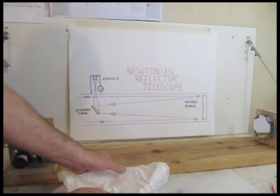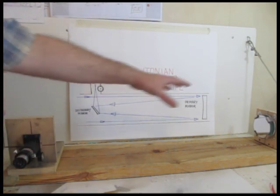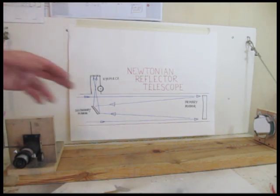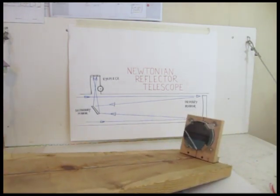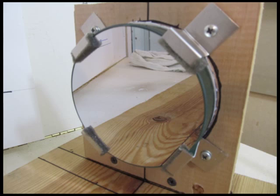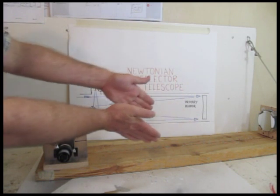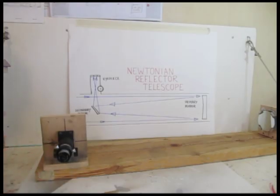It's a good-sized telescope, also pretty heavy. I think this will be three parts: this introductory part, then a part on how to make the actual tube for the telescope, and then a part on how to make the mounting that it goes on. It's really easy — there's not a whole lot to a reflector telescope, just a few basic things. But it's important that you get it all lined up nice and correctly so it works properly. I have the primary mirror mounted with some clamps, and then I have the eyepiece and the secondary mirror. The light comes in the telescope this way, bounces off that mirror, and is bent to form a cone. It bounces off a secondary mirror and then up through the eyepiece. You look inside to see the magnified image of the stars or the planets or whatever.